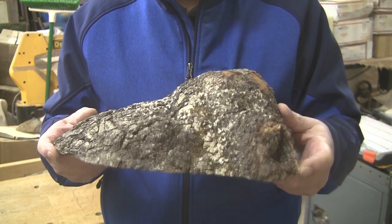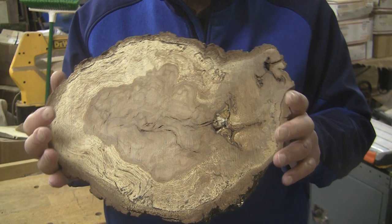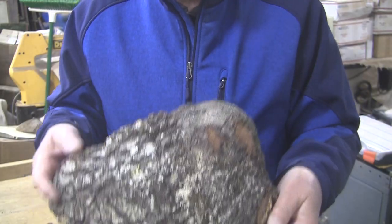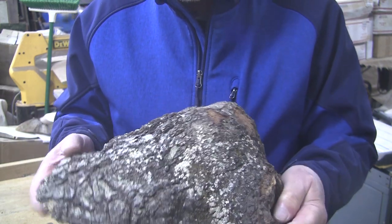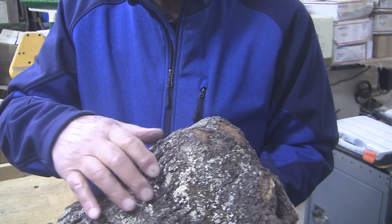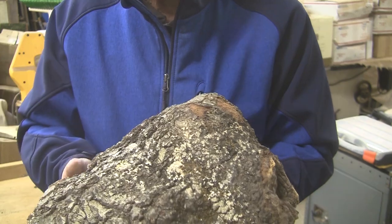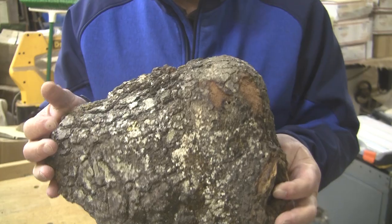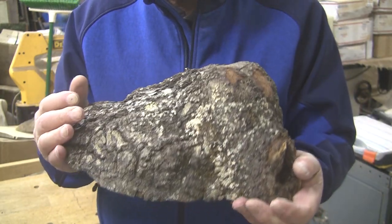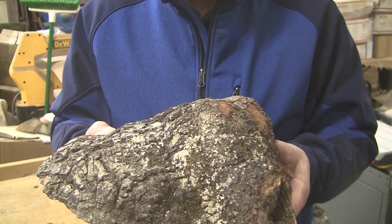So it's a dilemma for me. I still haven't decided. I've been looking at it a couple of weeks. What's your choice — you want this side up? Now this way, to me, this is a bonus. Let's say we cut a bowl in here — if I made a small bowl, we could make this look like a volcano that erupted and all this bark is the lava flowing down. I love that idea. But that's a small hole way up here, it's not practical. I think I'm going this way. We're still going to see that beautiful wood inside the bowl. It's going to be a big off-center bowl, off to this side, and I think that'll look the best.